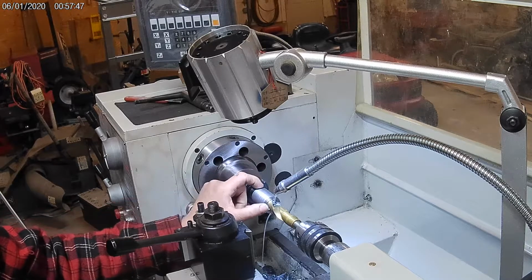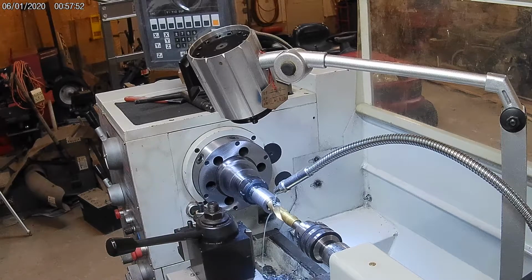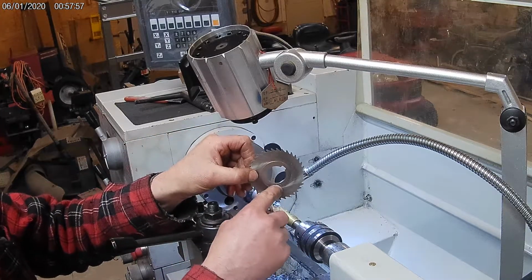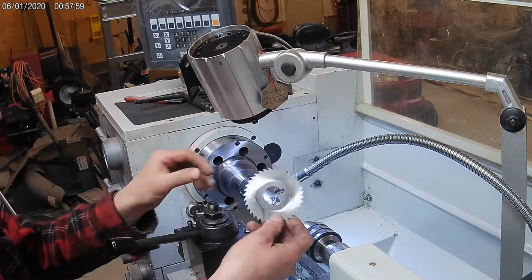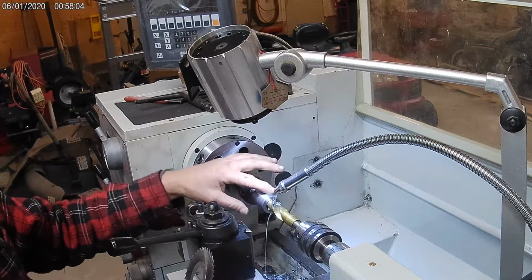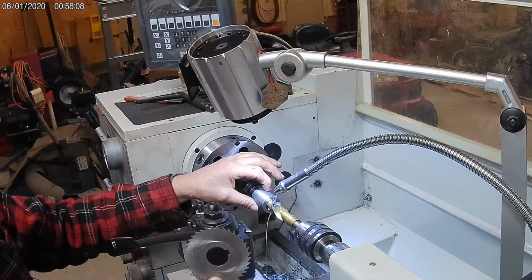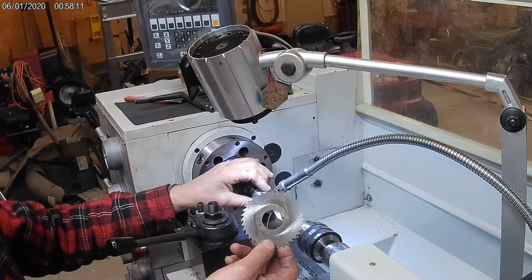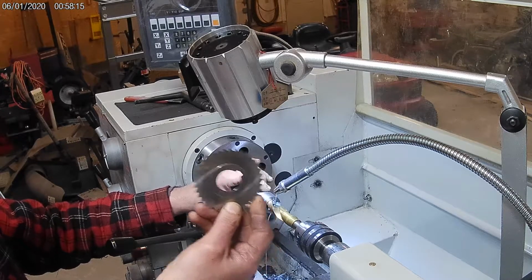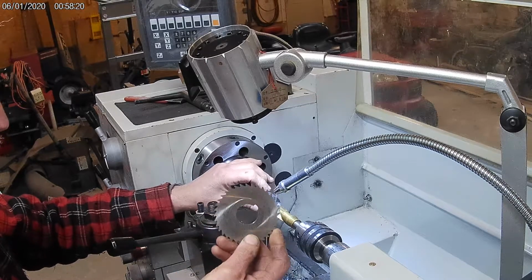And then what I'm going to do, the cap will have a stud that goes up inside that is turned to the inner diameter of the blade, which is a 1-inch bore in the blade. So it'll be probably the diameter of this on the outside, the bottom of the cap, which I think is 1 1/4 on that. And inside will be 1 inch to fit that nice and snug. You just want a nice slide fit, but nothing more than that.